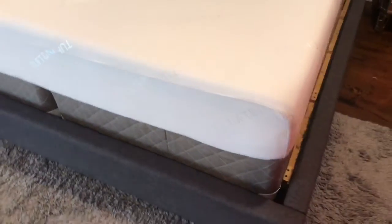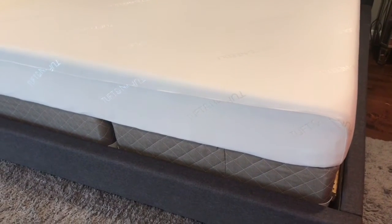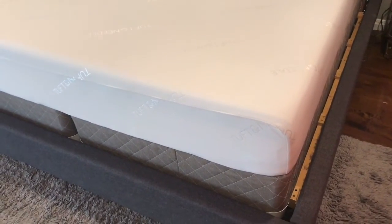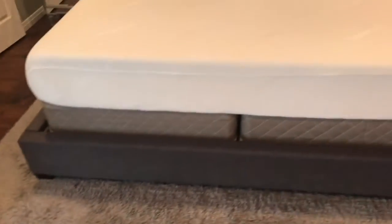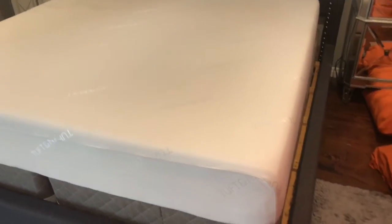So there you have it. It takes about half an hour. What you do is flip over the box spring, get rid of that black fabric on the bottom, use a small screwdriver to get rid of some of the staples, rip out that cardboard — there's plenty of it — and staple the little corner bits back on. I did not bother with the fabric; it takes a lot of staples and I think it's just there to hide from customers how cheaply these are made. And that fixes the squeak.